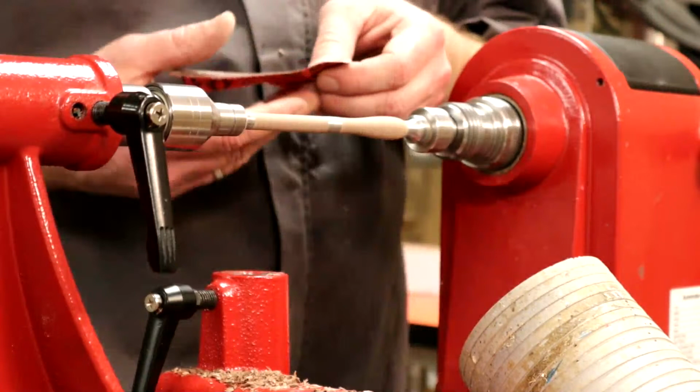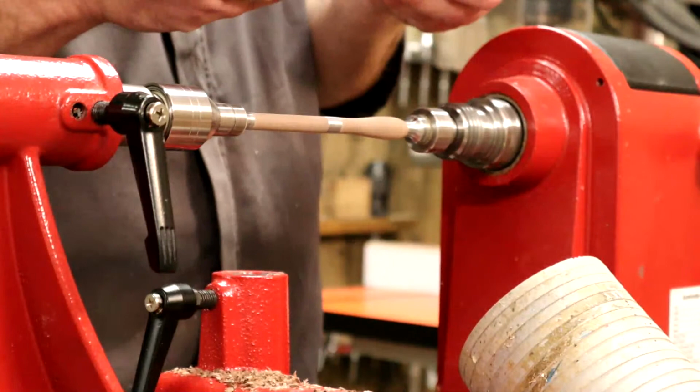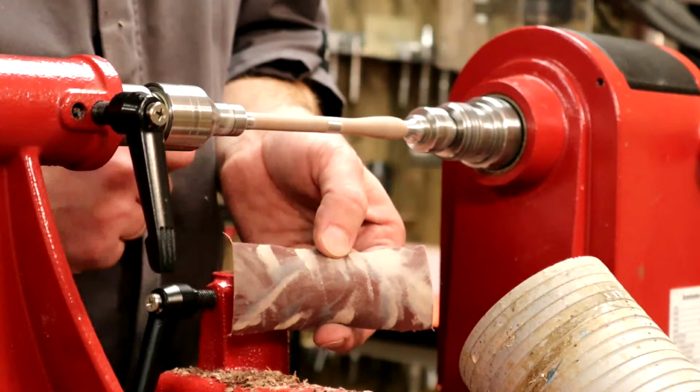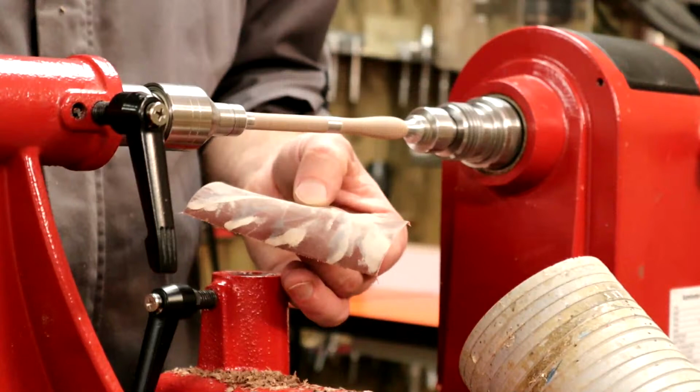Obviously, these are pieces of timber, they're going to be different, you know, package to package. I wonder if you can see this, yeah, there you go. On the abrasive there, you can see where the wood dust is, and then you can see that grey dust as well. That's the metal from the bushing. Now, I'm not taking a major amount of the diameter off of that bushing, but certainly that abrasive is coming to meet it.